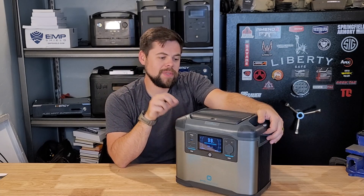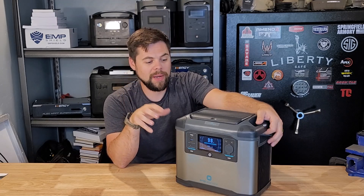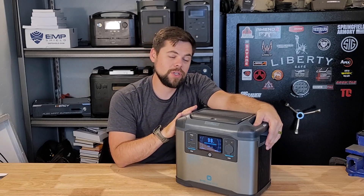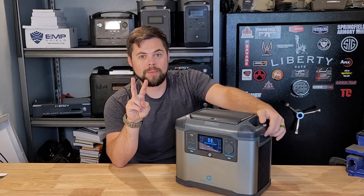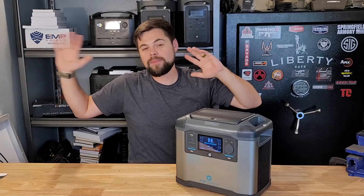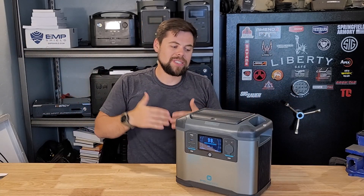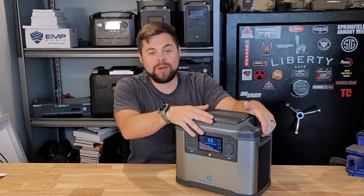If they had just made a charge controller with a little bit better charge parameter, I could easily connect up to 300 or 400 watts to get that full charge going in. The best case scenario I've found is to take two 100 watt panels in series, then another group of two 100 watt panels, connect those in parallel using a two-to-one branch connector — getting about 42 volts and about 12 amps — which is technically over-paneling it. But even doing that method, I still haven't gotten 300 watts to go in.